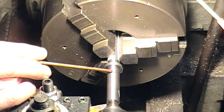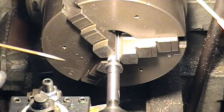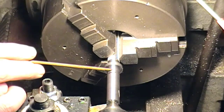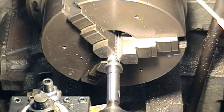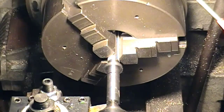I've got the sharpie marker again — this is plus on the 3/8 that I need. Reiterating: I'm getting the steps cut and leaving myself room for final finishing. We're going to come down from just plus on half inch to finish up just plus on 3/8. I've only got to go down about 63 thou, so we'll take 60 off and see where we are. Still on a pretty fine feed — I'll take 10 thou off and do a check measurement.